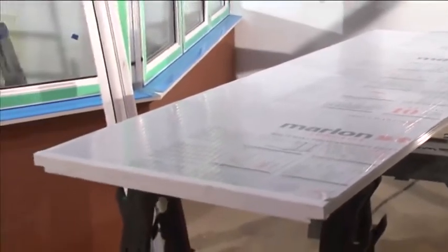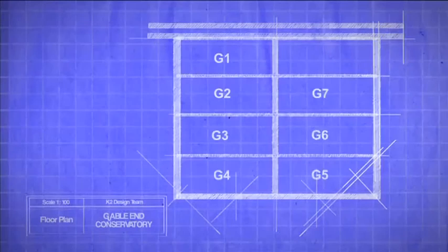Roof glazing installation. If your glazing material is polycarbonate, it's important to note that the surface, which is protected by the printed polythene film, is the surface that is on the outside of the conservatory. Each roof glazing sheet is labelled with the corresponding number on your roof plan. Please note that if your conservatory roof has glass roof glazing sheets, some may require jointing with muntin bars. See the muntin bars section for instructions on how to install, as well as the back of the installation guide.